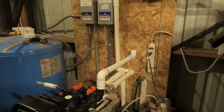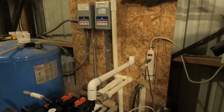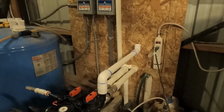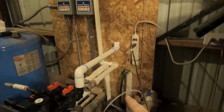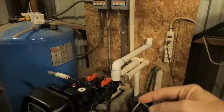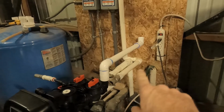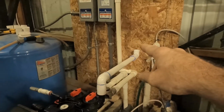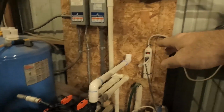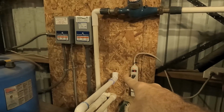All right, so last night I kind of got this roughly plumbed in here. So I wanted to try to get this where it's the least amount of cutting on these pipes and movement, since I'm having to change everything, since the diameter of these is a little bit wider. So what I ended up doing is I'm gonna have the inlet come in, and then the outlet's gonna actually drop down. So all I'm gonna end up having to do is cut the outlet pipe and drop it down about 2 inches. And then the inlet pipe here, I'll just have to cut it, reattach it, but then I'm gonna shorten it up here by about 2 or 3 inches, and then that should get it to fit down in that pipe.